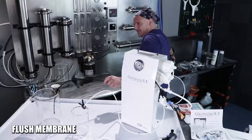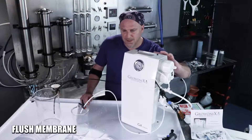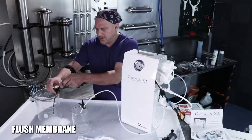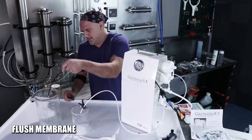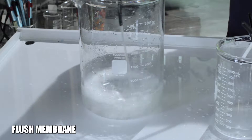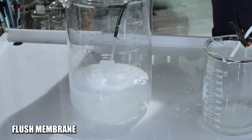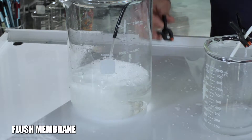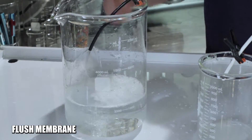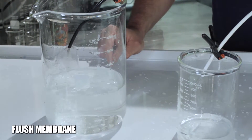Let's turn it on. We're turning the pressure on slowly — I can hear the water going through the membrane. It's already coming out the drain side and you can see it bubbling up. That's the storage solution coming out of the membrane — it's all fizzy and bubbly. The water is a little yellow in color too; it's not the clear water that came through our pre-filters. That's the storage solution.